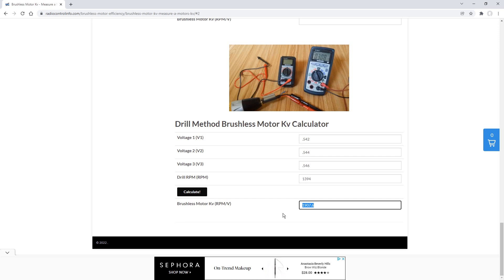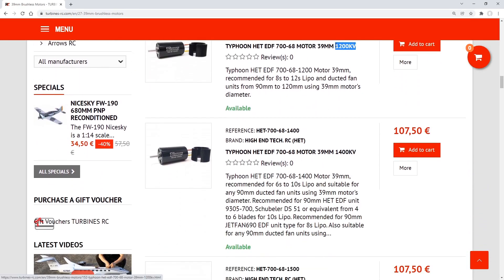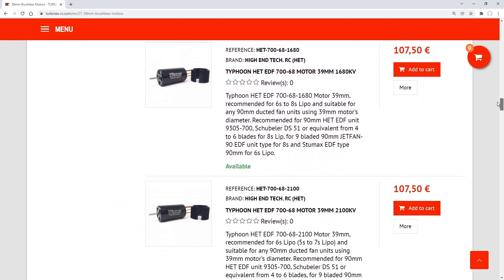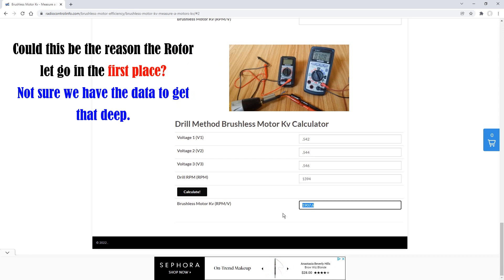Something has gone wrong, so the investigation continues. I'll be looking further into it — I'm going to grab another motor and see how close the motor spec is to the actual expected value. I'll take a look to see if they actually make a 1900 KV motor. If they don't, which I don't think they do, this may suggest internal damage to the windings where they shorted out and no longer have the same resistance, thus pushing the KV value higher. Look forward to seeing that in a future update video. As always, like the video if you did, and don't forget to hit subscribe so I can see you in the next one.